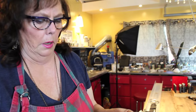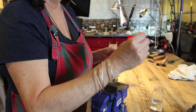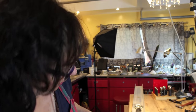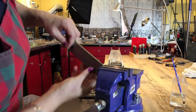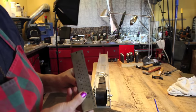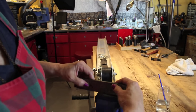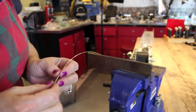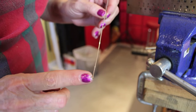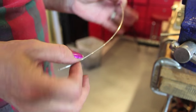So now we have our first pull. This wire I wrote down so we'll compare later how many times it takes. The two pulls through the draw plate in the vise brought it from 16 to almost 17 gauge, so it's going to take a few pulls if you want to get it down to 22. I'm going to go to 18 now — same thing, only doing this twice before I anneal. What usually happens if you're really pulling down a lot of wire is the tip ends up getting mangled and breaks off on you, so don't be surprised if you have to re-tip this thing. I'll anneal it and draw it down a little more.